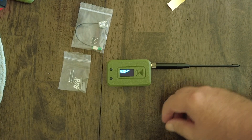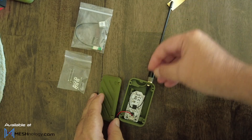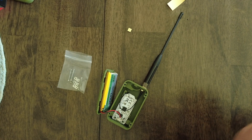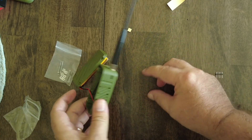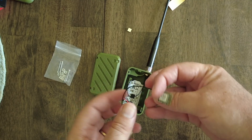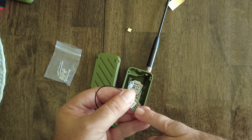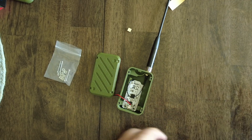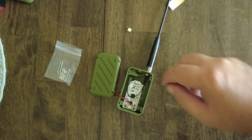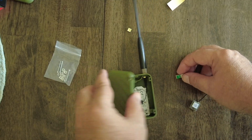I want to do this a little bit differently — I want to also install a GPS in this. This unit by default doesn't come with a GPS. I'm going to try and install this GPS — I can't believe the size of these now, just look at how unbelievably small that is. GPS typically has four wires: voltage, ground, TX, and RX. I'm going to connect that up to the Heltec and show a schematic of how it's connected. Let me go do that soldering quickly and see if I can get this GPS unit installed inside this case.